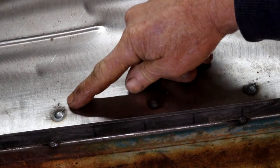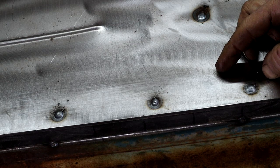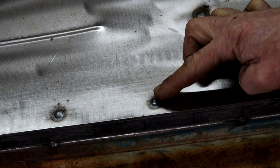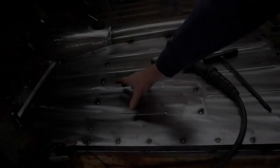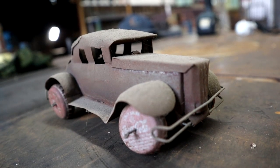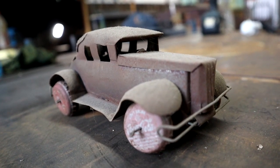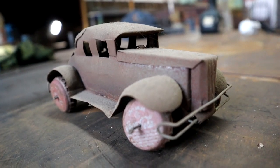That's what my little plug welds look like before I grind them flush. I crank up the amps on my welder quite a bit — I want that instant penetration. I'm sure if you were to doodle for a few seconds longer you would burn right through. I can't call it a spot weld because it's got a little hole, so it's a plug weld. It actually looks quite a bit like rivets, doesn't it? Dude's got to rest the old back a little bit — it's worn out. What do you think about this rat? Look at those wheels made from Coke bottle caps. It's not very big. Bought it from a dude that was selling them next to the road.